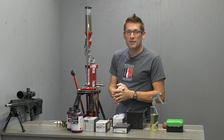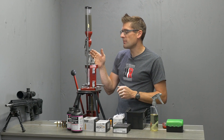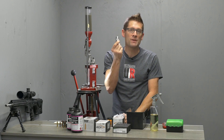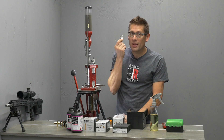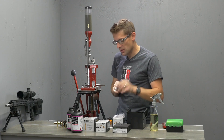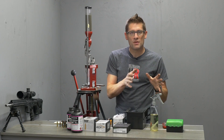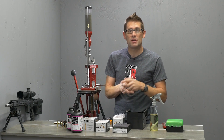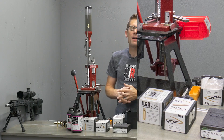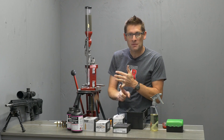If you're set up to reload .223 Remington, you're almost all the way there to reload .22 Nosler. You just need to adjust your powder measure and you need a set of dies. I'll also note this is an early production sample of the LE Wilson .22 Nosler case gauge — a very important tool to have, and it is cartridge specific, so any cartridge where the case is different, you're going to need a unique case gauge. Setting up for .22 Nosler is just like setting up for .223, and if you're already set up for .223, you're 99% of the way there. And that's a good segue to talk about some of the potential problems and solutions when it comes to developing a load for .22 Nosler.